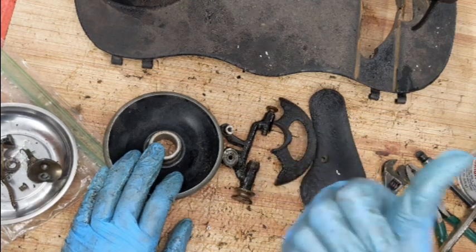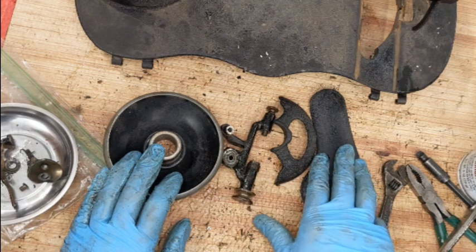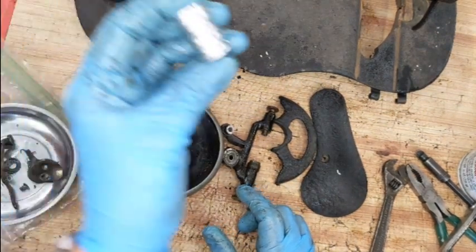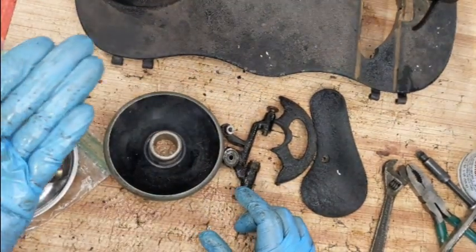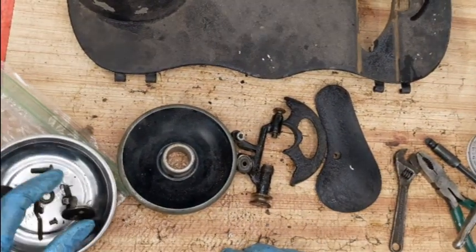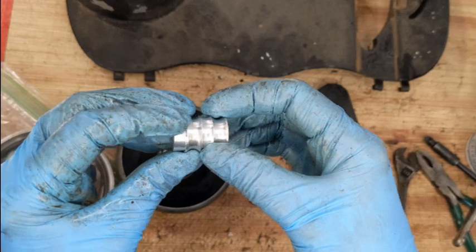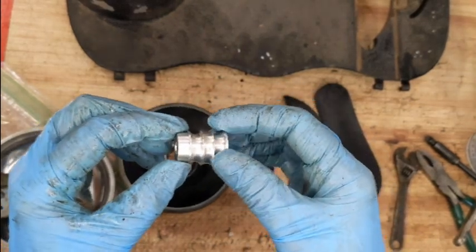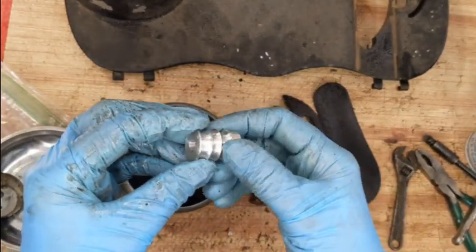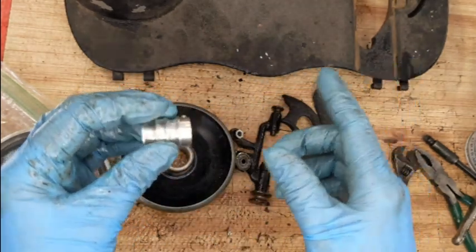Can't tell you what. I've got a cabinet base to do, which is an unusual size. I've got to figure out the Revco. I've got to deal with the motor issue because I'm going to be doing a different pulley. I'm going to be using one of my pulleys here because the way that it was set up, you couldn't run the bobbin winder. There wasn't a belt for that. So I'm using one of my belt improvised things, and this is one I do have for sale in my store. Basically, I took a design from an old machine that passed through my shop, took the specs off of that, and had them remanufactured. If you're interested in these, they are on my website, Promethean Sewing Machines, but I will show you in the next video.